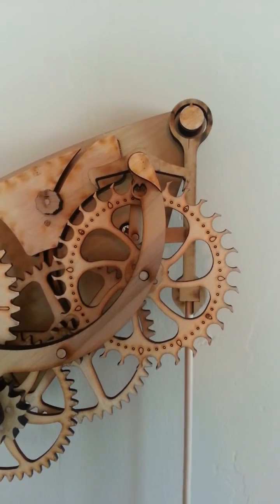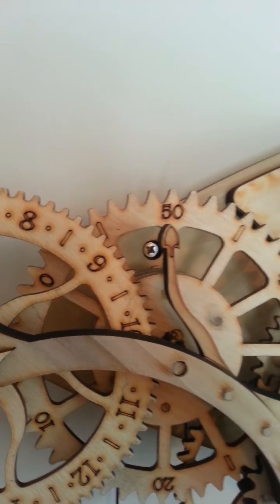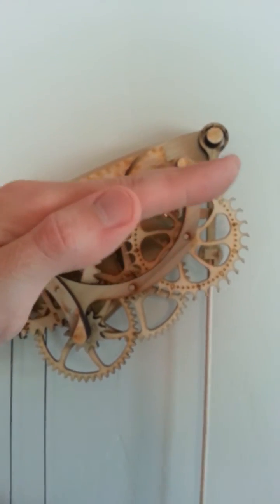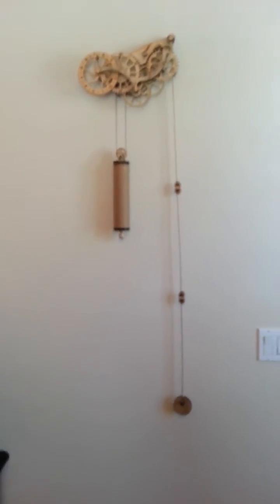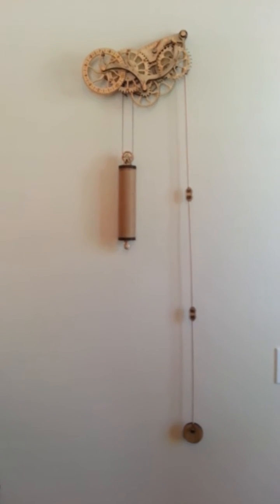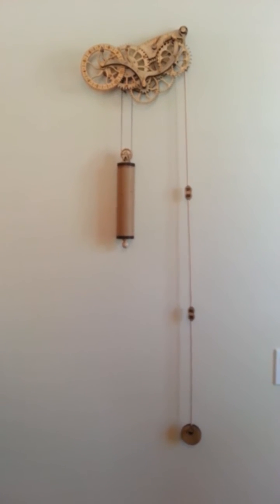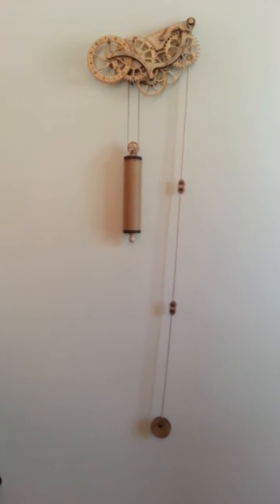You can see the screw behind all those gears, and then there's another screw right there. Just tilting the clock ever so slightly this way allowed the pendulum to continue to run. And the result is it's never run this long before. So if you have one of these yourself, try to stare really hard at those arms and see how they catch — because that was the key for me.